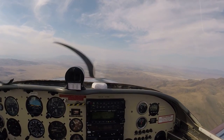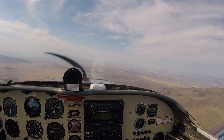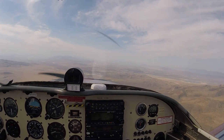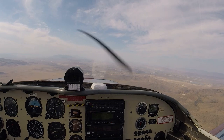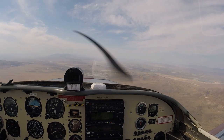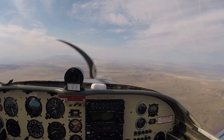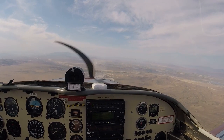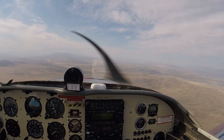I'm going to use about 6,100 feet indicated for this test. We'll do a three-leg GPS test — we'll choose a heading to start with. I'm in a southerly direction right now, heading about 150, so we'll start with that. Descend down to 6,100, start on a 150 heading, and once we get established we'll go wide open throttle in level flight at 6,100 feet. Once stabilized, we'll record manifold pressure, wide-open-throttle RPM, and GPS ground speed. Then we'll turn 90 degrees west for the second leg, and record GPS ground speed.